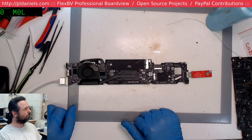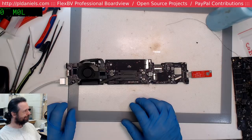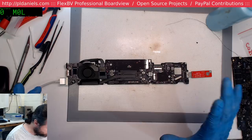Same thing. Jumps up to about 100, 90, 100, and then drops back down to 21, 15. Yeah, so we get 5V, we get power, but the USB one, the middle one, is indicating CPU activity, and we're not getting that, which isn't surprising.